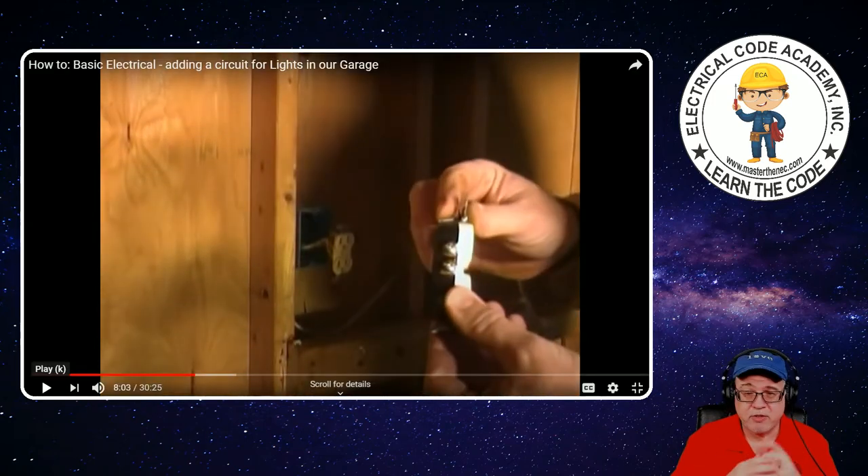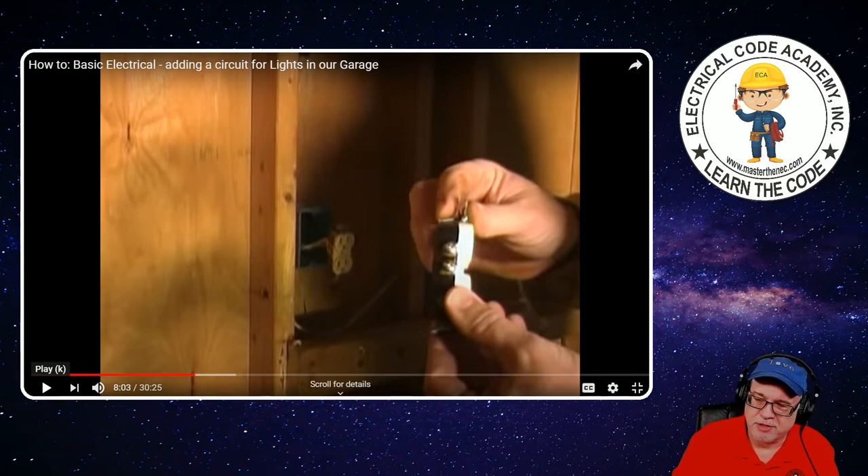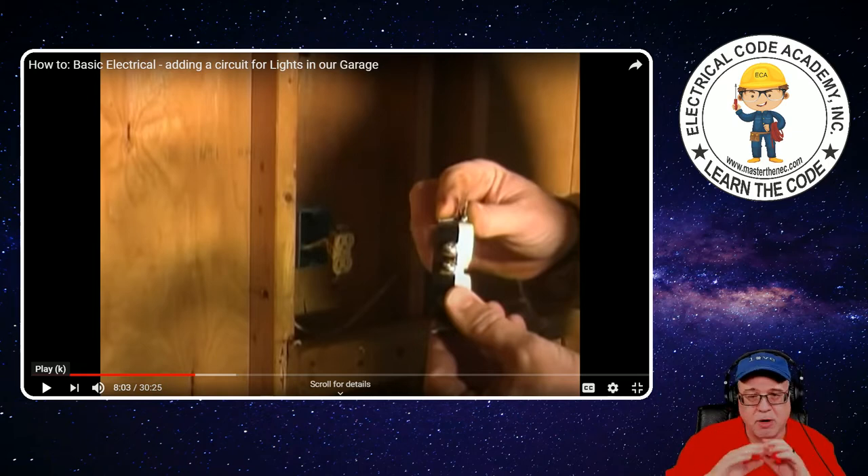I hear a lot of terminologies — and this is okay. When people say 'ground wire,' you don't have that defined in the National Electrical Code. That is basically an equipment grounding conductor — sometimes referred to as the safety conductor. The circuit conductors are the black and the white. The equipment ground is not part of the circuit conductors — it is part of the safety component that allows an overcurrent device like that breaker to trip on a ground fault. So it's called an equipment grounding conductor, an EGC, not a ground wire. We know what he's saying, so we're all good with that — layman's terms.